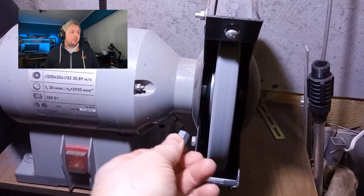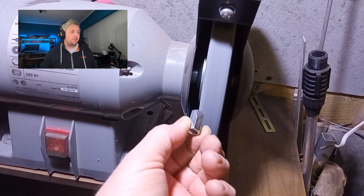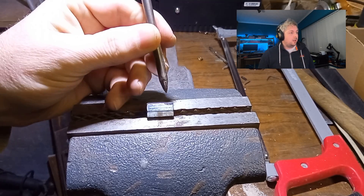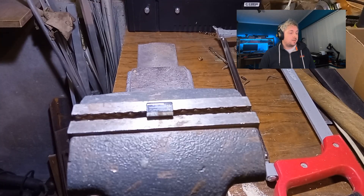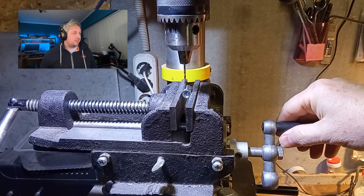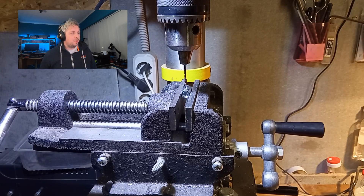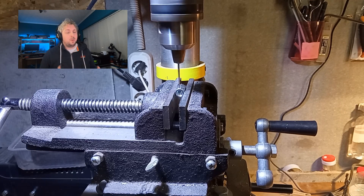Because these nuts are quite wide, we're going to put a flat edge on them so that we can drill a hole on one of the edges. This gives us the narrowest profile we can come up with. Looking back at the video I made on the pickups, there was an issue where we crept too wide in the design and it wasn't going to work, so we had to redesign. Next we're just going to tap a little hole — start an indentation so we drill something in the center in a controlled hole. It looks like a machine clamp is being used here, which looks pretty useful.